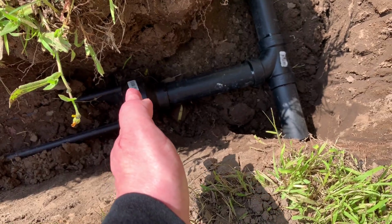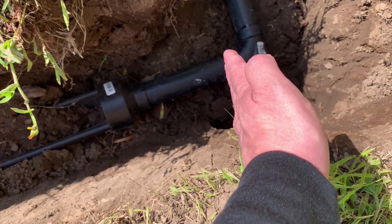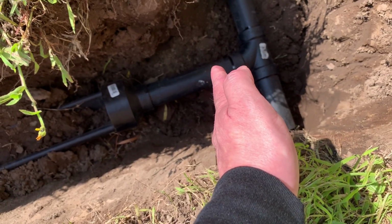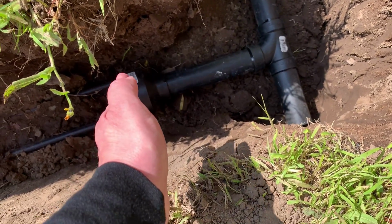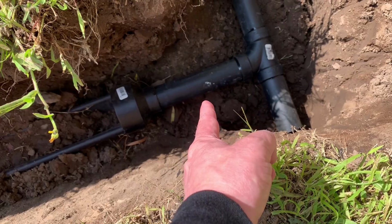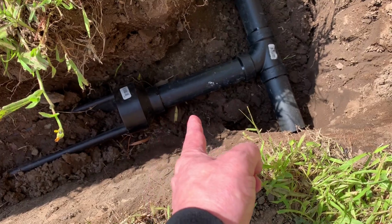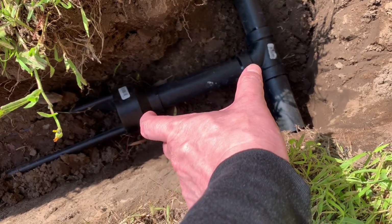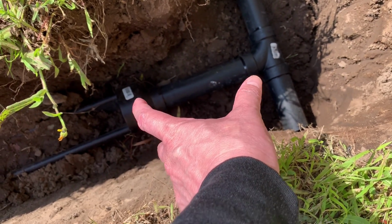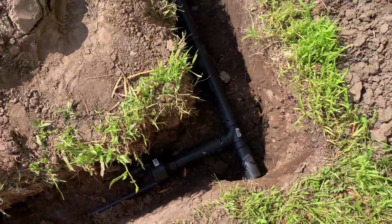If you cut it over here, you're going to end up having to cut the aquifer pipe. You're going to have to move the header pipe. But since we cut it from back here, we use this centerpiece to actually make the difference. And that's very important because, again, this difference on all the other aquifer pipes, you're going to see it in the other trenches, is different. So they're going to vary from one to the next. So let's go look at the other one.